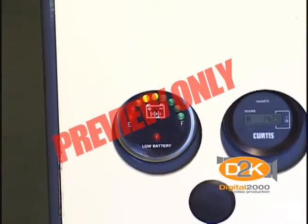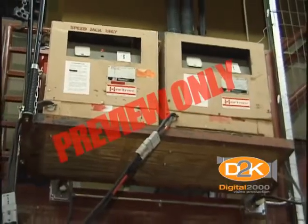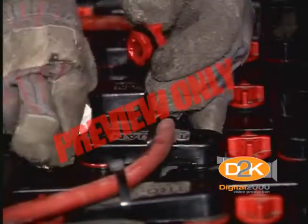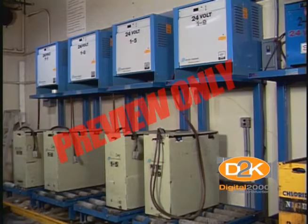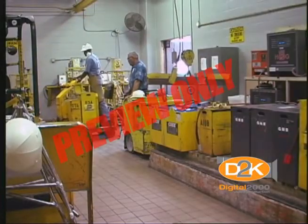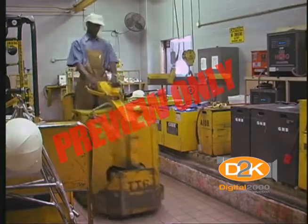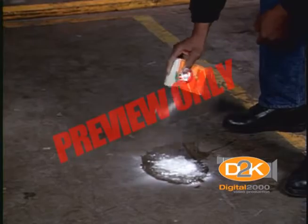For forklifts that use batteries, battery charging installations shall be located in areas designated for that purpose. Facilities shall be provided for flushing and neutralizing spilled electrolyte, for fire protection, for protecting charging apparatus from damage by trucks, and for adequate ventilation for dispersal of fumes from gassing batteries. In other words, a special area must be set aside for charging batteries and must have adequate ventilation as well as baking soda or other material to neutralize any spilled acid.